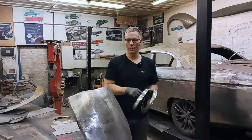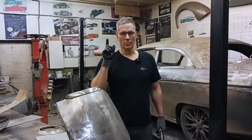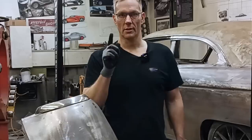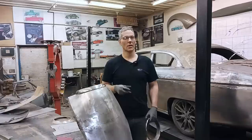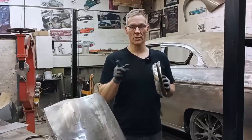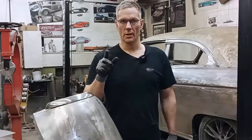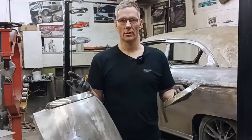Yeah, sure, you can go ahead and weld these rings on here and you can get it done. But in about 3 days, you're gonna get a thing called galvanic corrosion. I'm not gonna get into the science of it, but essentially, when you join two dissimilar metals together, one's gonna break down. We can't have them breaking down. We want it to be happy, joyful.